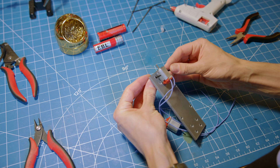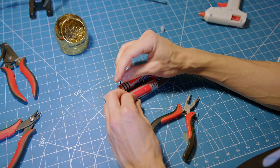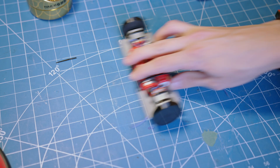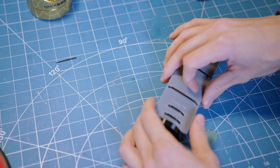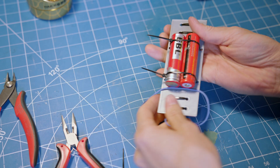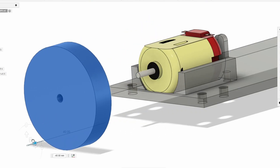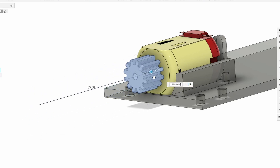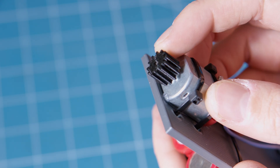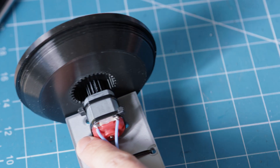Since this was just a test I didn't wire anything together yet — I wanted to see how the components would balance on the wheels. My initial plan was to have all the heavy components on the bottom and the electronics and vape cartridge on top, but the motors ended up being too far below the center of gravity, preventing the assembly from self-leveling. To solve this I swapped the motors to the top of the tray while leaving the batteries on the bottom, and the new weight distribution worked much better. I then had to use gears as wheels since the motors would be too tall and block the smoke exit.